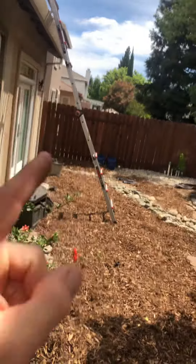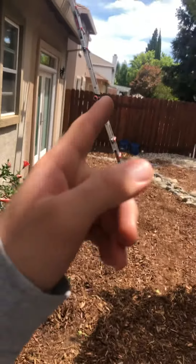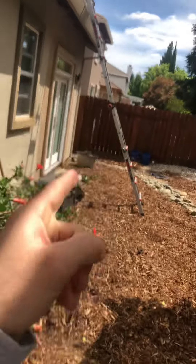The ladder is sitting there. The ladder should be set up at a 75 degree angle. So you know what a 75 degree angle is — an easy way to judge this is: this is roughly 10 feet vertically, as most gutters are.